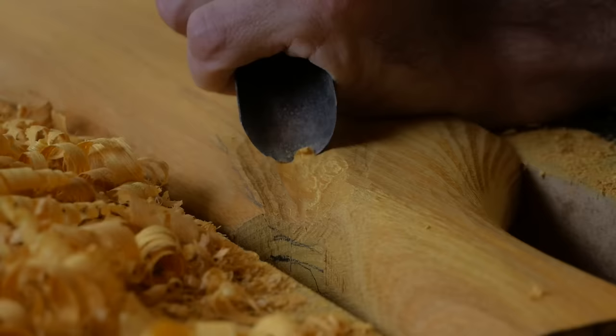You always want to sight it and make sure both sides are the same — if one side is different than the other, that drives me crazy. I want it to be even and look the same. Watch out for a mistake here where I run my chisel right into the metal part of the vise. I swap to my Swedish chisel, then actually go with a wider chisel. My wider ones are always at a lower-angle bevel and I think there's a little more control there. This is the V-chisel — just working that drop-off down into the pistol grip.